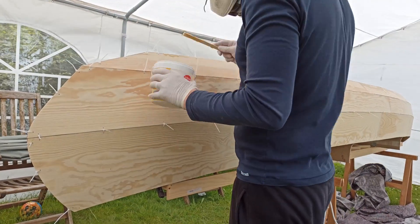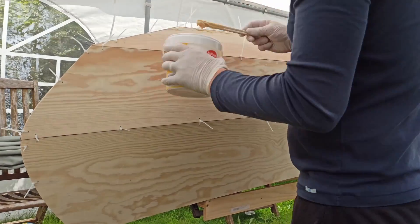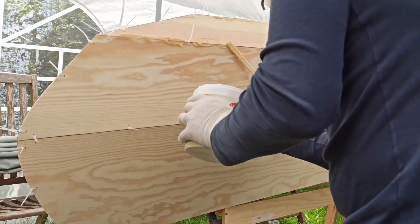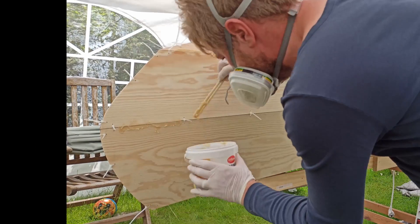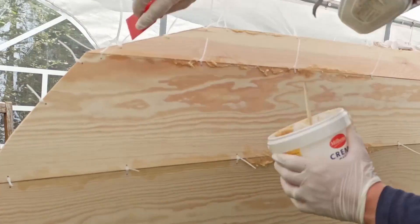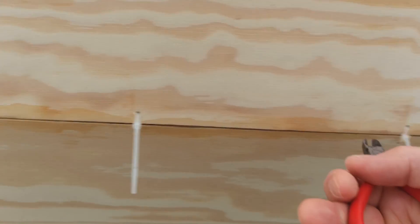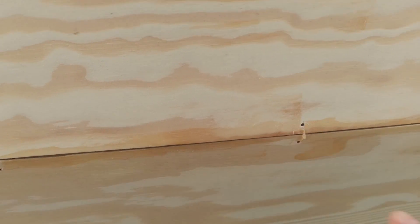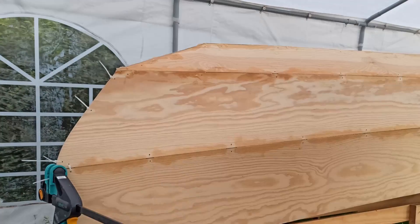Next I filled out the gaps with a mixture of epoxy, grinding dust, and as much cotton fiber as needed to give it a consistency of peanut butter. In the first step I left out the areas where there were zip ties so I could remove them easily. For removing the zip ties I used a pair of pliers. Then I could fill the left-out areas and the holes for the zip ties with the epoxy paste again.